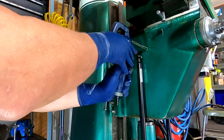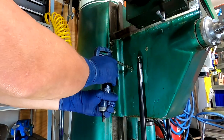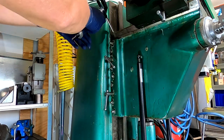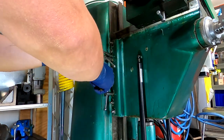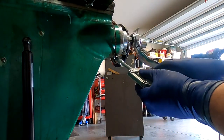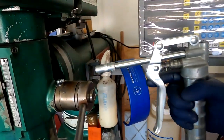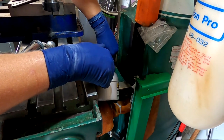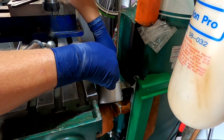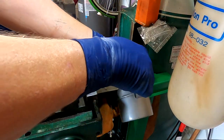Okay, our oil fittings — we're going to hit these. That number of pumps in there will be fine. And up here there's one at the top, right behind the way. And down here. All of our turning points are grease points, so right here. And then of course up here, this is your last grease point right here. Let's not forget this one little spot back in here — you can see that depresses, so you want to depress the end of an oil gun down in there and get some oil going down in there. A little bit extra on the ways doesn't hurt. Never hurts to add extra.